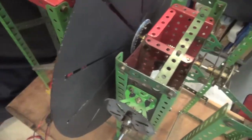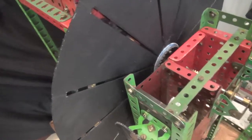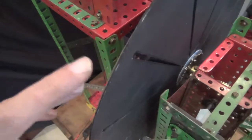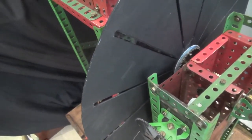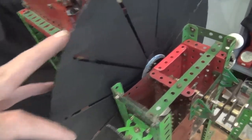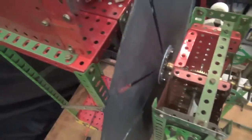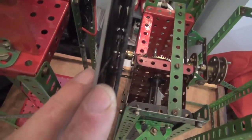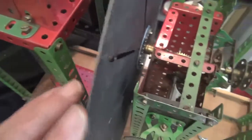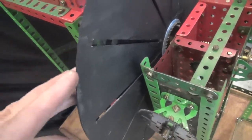I was kind of aware that might happen, but I thought once it gets going it'll tend to stop. It'll just happen at the beginning and end of the turning. But because there's no real flywheel effect — the shutter is so light, and the disc is just a single Perspex sheet so it's quite light too — they're not that regular in speed. I've added a little flywheel over here to the drive shaft to help a little. Also the shutter disc and the picture disc are touching each other now and then, and that's causing slippage and making the picture jump sideways on the screen. No mysteries — we've got to sort that out.